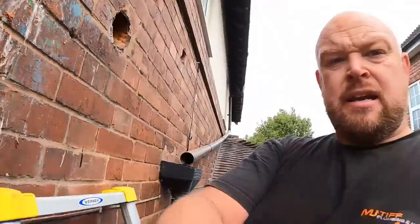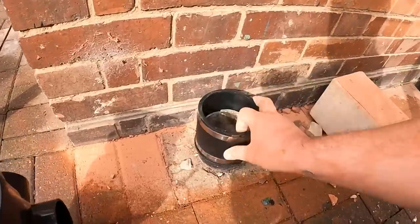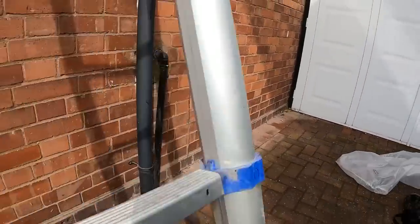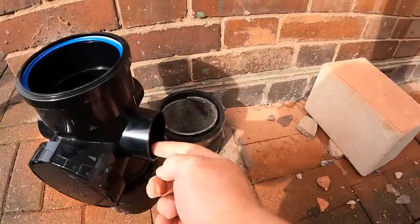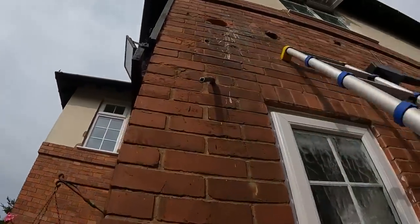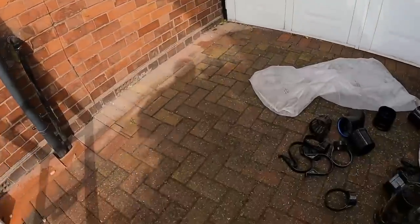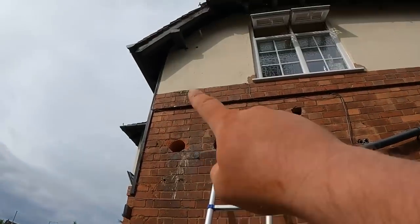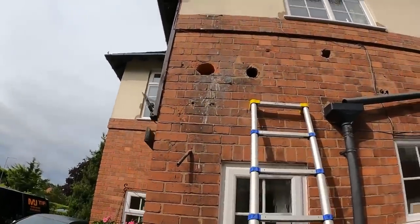Right, let's begin getting this stack up, I suppose. Now what I'm going to do, because obviously we're cast iron here, I'm going to start with an adapter collar. So that's going to go on there, then we're going to come up in 4 inch. We've got to pick up that 1.25 inch base and waste at some point, so I'm going to put the rodding eye around that sort of height, because we can drill this boss out in the side and use that for the base and waste, and then it's up into where the branch is going to go, straight in there. And then obviously we've got to pick up the bath and the basin, and what we're going to do is use strap-on bosses into the side of the soil stack when it goes up, and then it'll go up 45 over the soffit and then to a bird cage at the top. So it's just going to neaten up here a hell of a lot more.